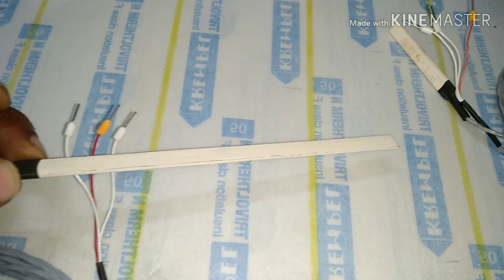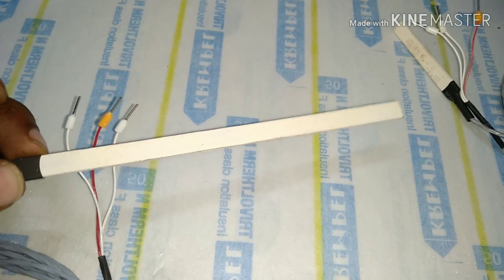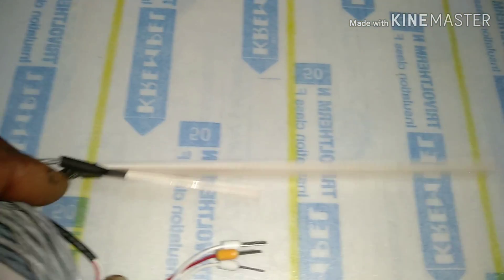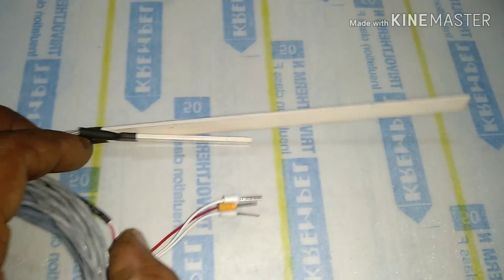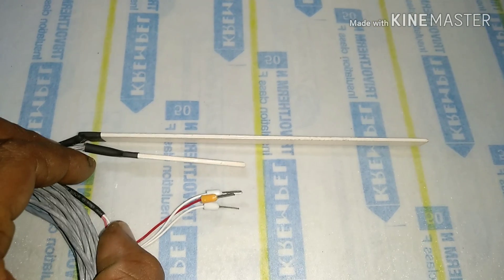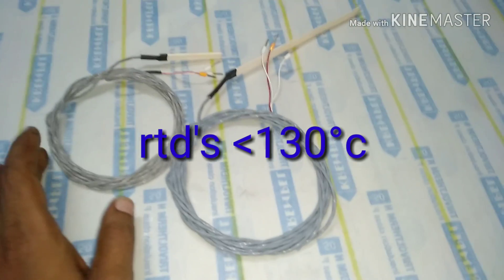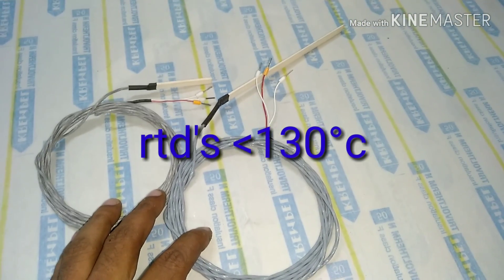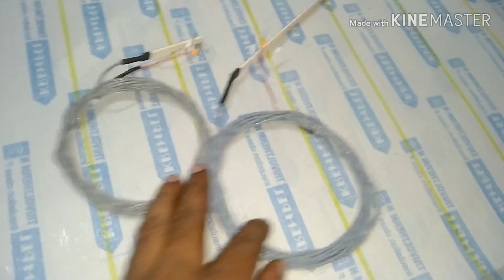On screen you can see there are two types of RTDs — basically the sensor plates are of two different lengths. The only reason for this is the application. RTDs are basically used in machines where the operating temperature is greater than 130 degrees Celsius. Now let's see how the fitment procedure is done in new windings.